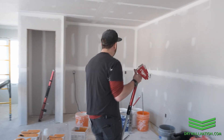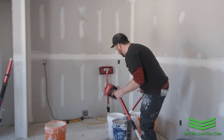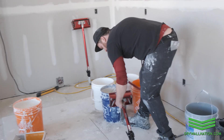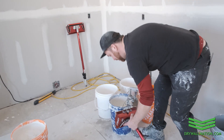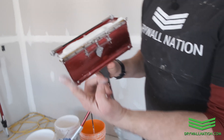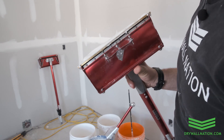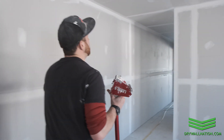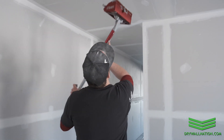I'm going to go ahead and fill our flatbox up again. Put it into our nozzle and fill the box back and forth — there we go, nice and filled. It's always a good habit to take your finger and just clean the back of your blade so any little chunks of dried-up mud get removed and stop from dragging in your mud.